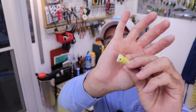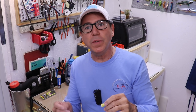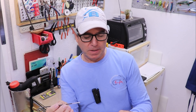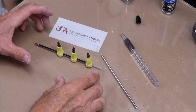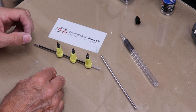All the holes are drilled. I used a 1/8 inch bit because I need to align these guys in the mold with a small rod. A lot of people won't have a random 1/8 inch aluminum rod laying around, so I'm going to use the inside of an old pen — it slides right in and fits snug. These will sit inside the mold case so I can pour the silicone around them. Now let's make the mold case: I'm going to use a piece of glass as a base and some little tabs from an old box for the sides, marking about one and three-quarter inch height.